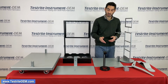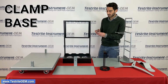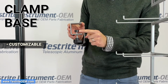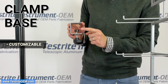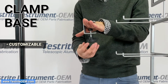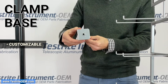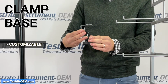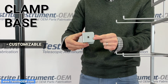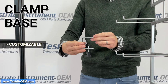Okay, next I'm going to show you one of our clamp bases. We make clamp bases every day here at Testrite. We can make them for whatever your ID is. So you tell us the thickness of your counters or the range of thicknesses you want. As an example, you might say, well, my counters will vary from 1 inch thick to 2 inch thick. You can either have a countersunk hole, as you see here, or you can have a male thread pre-installed welded. Sometimes we'll even do screws from below, although typically those will need to be Allen head so you can get in from a right angle.